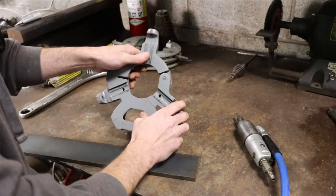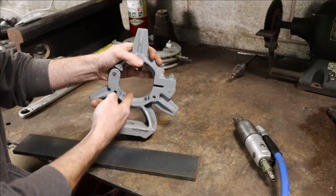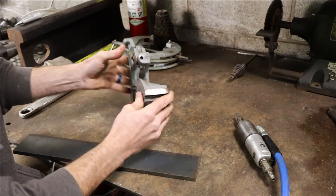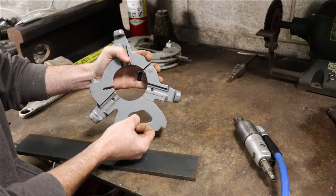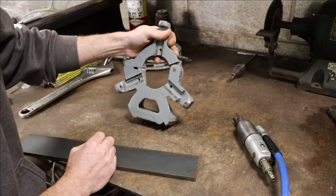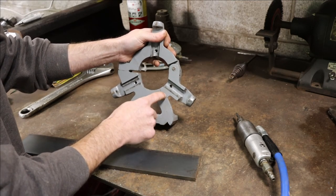So after looking at this thing a little closer, it's probably going to be a three-step repair. Because it's so contoured here, I mean there is a lot of shape in this. I'll probably come in and burr out the top here and repair that, then come in, do the bottom or the back side the same way, and then maybe have to come in and burr this crack out in the front. I want 100% penetration on this, and I don't want a big gob of brazing alloy left over. I just want it to look like it does now once it's repaired, and you know, it'd be a quality repair instead of just a hack job with a bunch of bubble gum all over it. This will be easy, this small crack, but this one's going to take a little time.